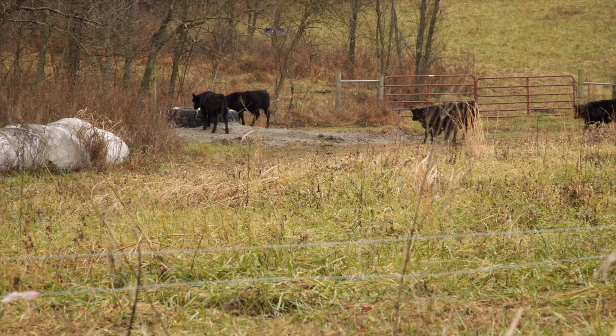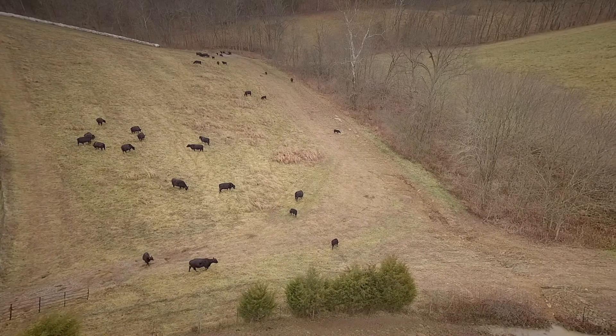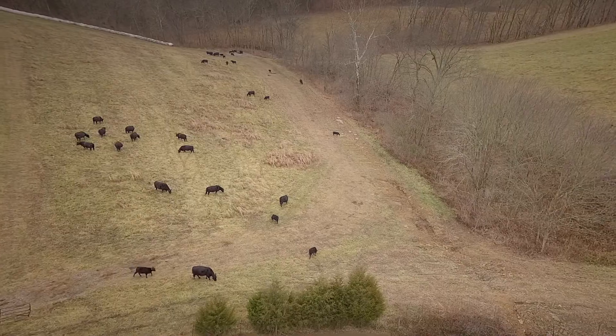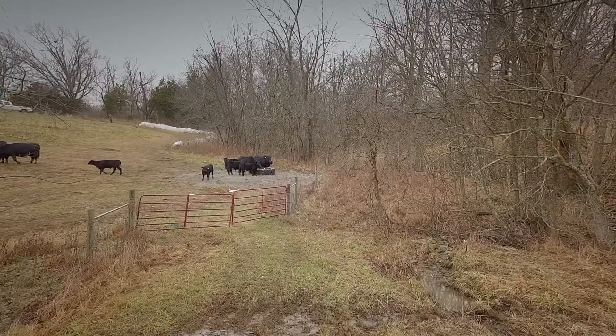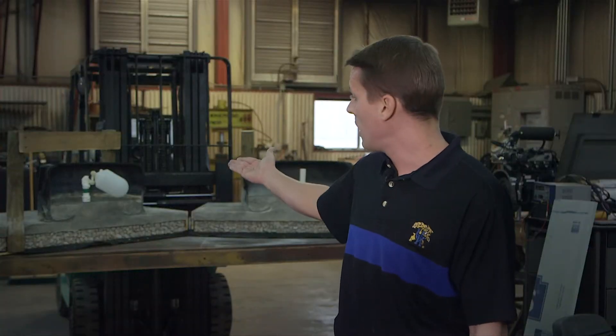What we've seen so far is that cattle do respond well to these tire waterers — they've taken to them and use them regularly with no issues. As far as longevity, we've had some minor issues with plumbing that you might experience with any watering system having heavy livestock traffic, but for the most part we expect the longevity to be as good, if not better, than your average commercially available watering system. With the addition of extra concrete, exclusion fencing, and the heavy traffic pad, we feel like this is going to be an excellent option for producers.